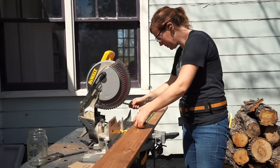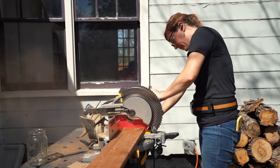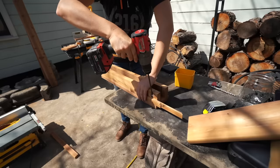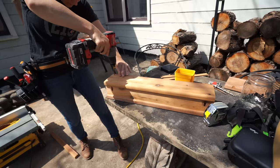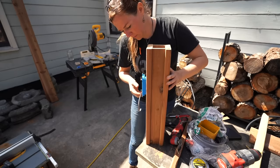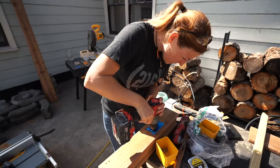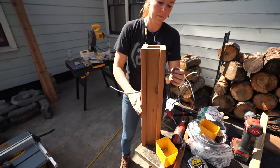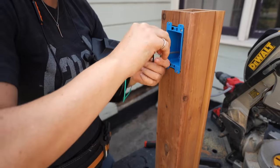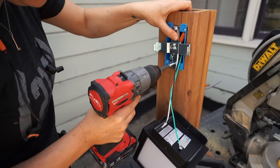Now the trench can be filled back in and I can get started on making the lamp post. You can make this as tall as your needs or tastes prefer, but my friends wanted something low to the ground. This post is only 22 inches tall, which allowed me to get all four pieces from a single board. I used pocket holes and screws to make a hollow box, then punched two holes and placed electrical boxes on the post — the lower one for the outlet and the upper one for the lamp. I fed wire through leaving room to work on both ends, then wired in the lamp connecting black to black, white to white, and green to green.